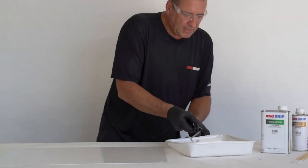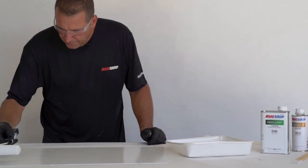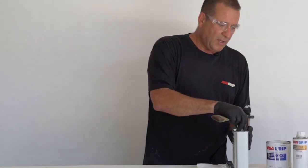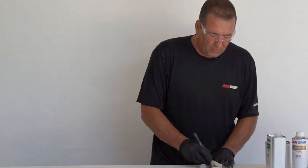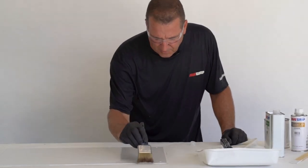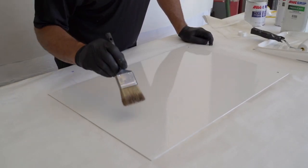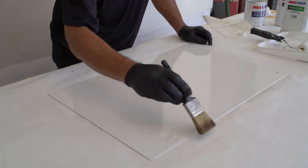Make sure you don't leave any little voids or holidays. If you're tipping a hull, generally it's a little bit better if you're tipping from top to bottom, as opposed to sideways. Ideally, if you could reach from the rub rail to the boot stripe, that would be your best bet. Just a small amount of paint and we're just going to slightly tip, get these bubbles out. Hold it at about a 45 degree angle. You can see the bubbles here and the roughness — and this is what happens after you tip it out. You don't want to go back and forth; it's the same direction.